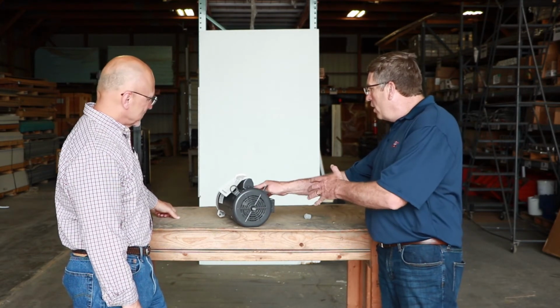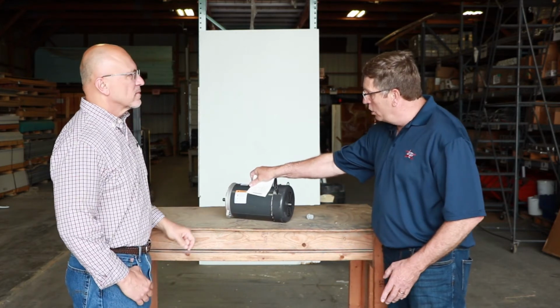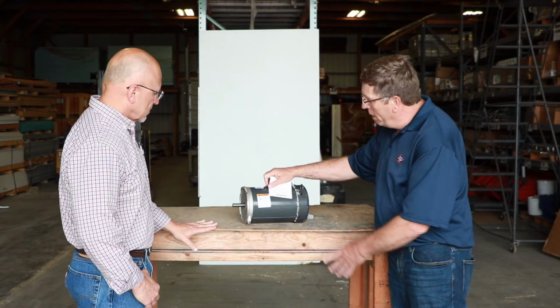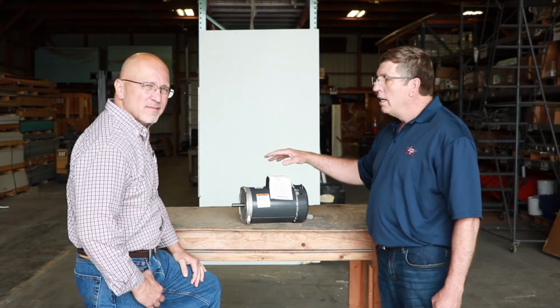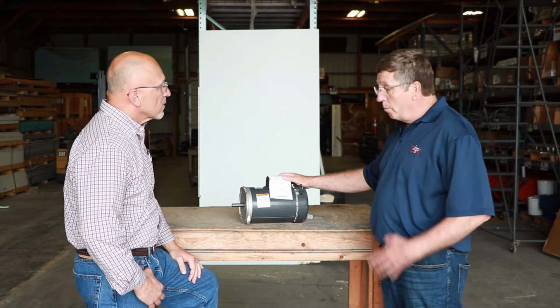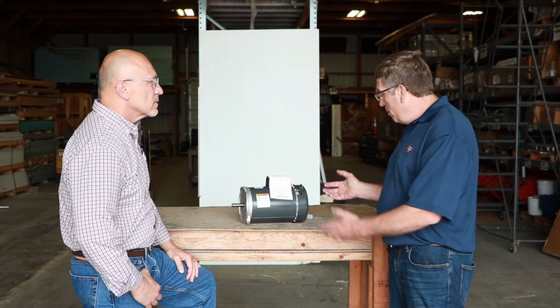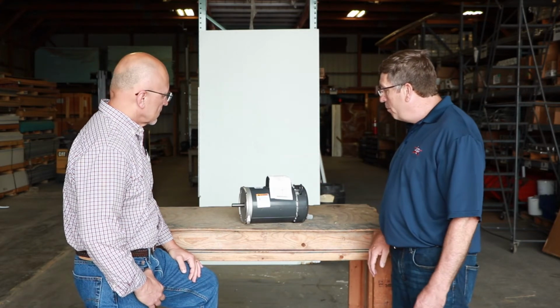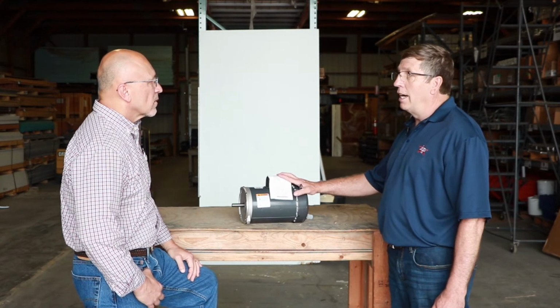As well as whenever you go through the engineering of this motor, to look at a motor, we're just not going to see those differences. But we went back to our manufacturer for the capacitors, for the start windings, made it 50-60 hertz, so it's interchangeable in different places around the world. And we think all those factors add up to make this a motor that probably has a lot of advantages and is going to last a long time in your barn.